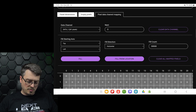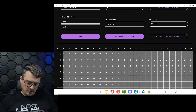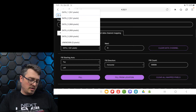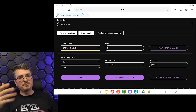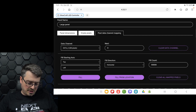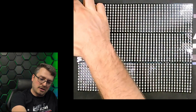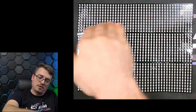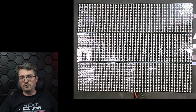On this page, you'll choose several parameters to determine how to associate addresses to each pixel in your panel. We've created a 44 by 33 panel, and at the top you can choose your data channel to start. We're going to start with data four — I have data four at the top, data five in the middle, and data three at the bottom. We start at zero, which is the first address, and we're doing a horizontal serpentine — it starts at the top, goes over, comes down, goes back over, and so on. If you don't do serpentine, it just fills rows without actually snaking back. Keep that in mind depending on what kind of panel you're using. Most pre-built panels like this are serpentine. Also make note of your starting point — if the panel were upside down, your start point would shift. Set the fill starting axis accordingly; I have top and left, which is correct.